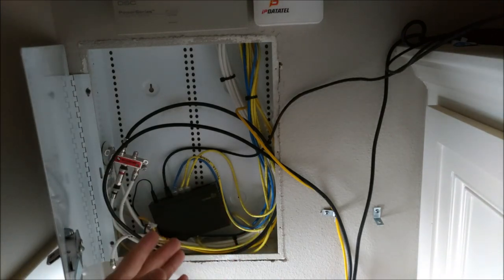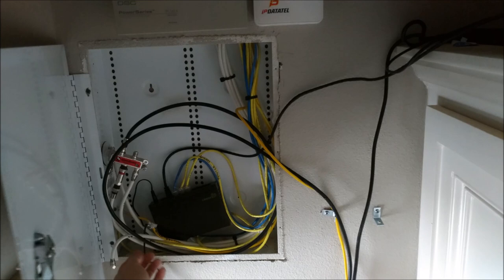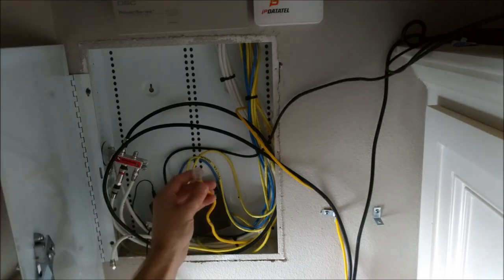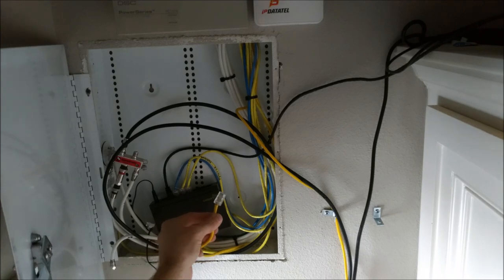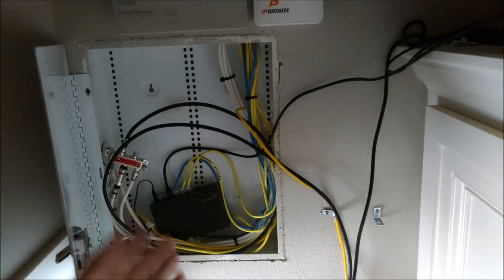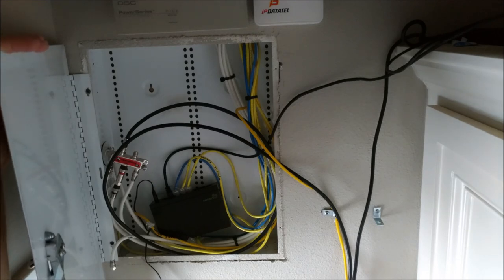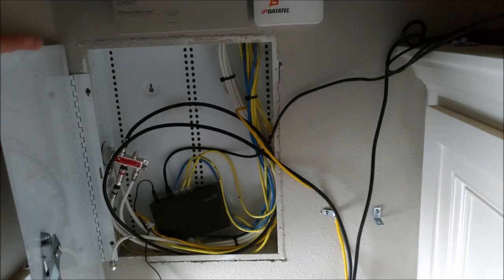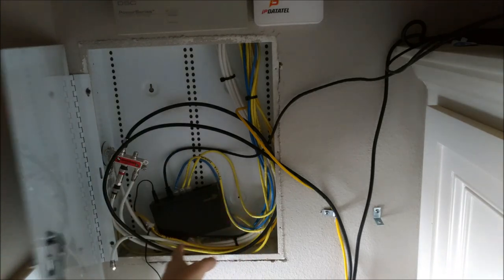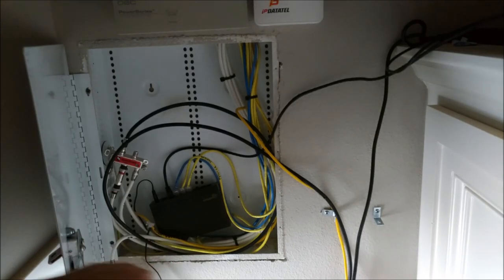As you can see in my closet here, some of the wires are yellow and some are blue. The blue are ethernet wires and the yellow were originally telephone lines. I've chopped off the ends and rewired them as ethernet connections. If you're lucky enough to have category 5 wiring, you can actually get a gigabit network even if the wiring was originally intended for telephone. Now if you have older telephone wiring and it's only four-wire — all of this wiring here is eight-wire twisted pair.